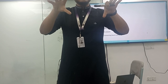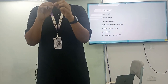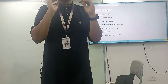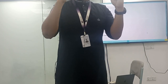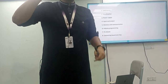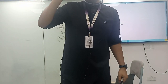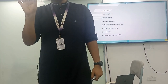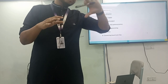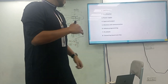That's the role that has been set for analog and digital. So there are some special pins. These are called PWM pins, pulse width modulation. These pins are very efficient whenever we work with speed and the clock, the pulse, relevant to the clock and pulse speed. So to work on the driver module speed, you have to connect your module with the PWM pin. An analog pin is good, but especially the PWM pin is made for this. Okay, so we'll talk about it later.